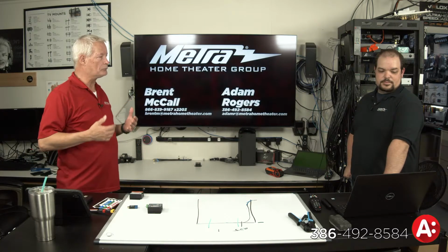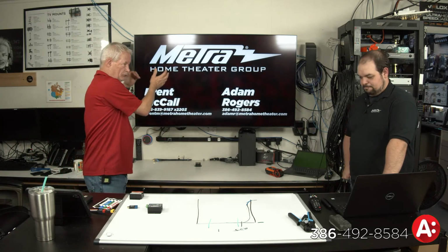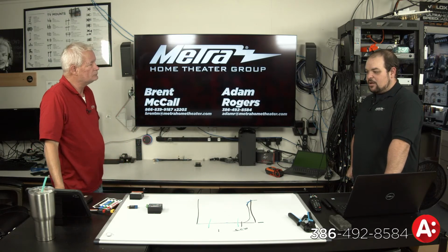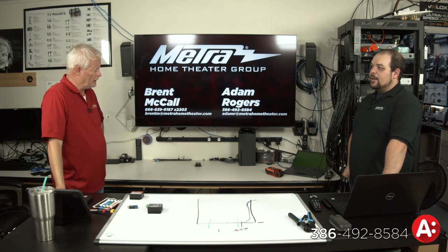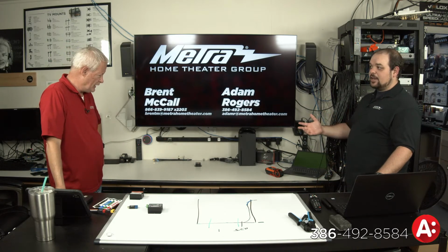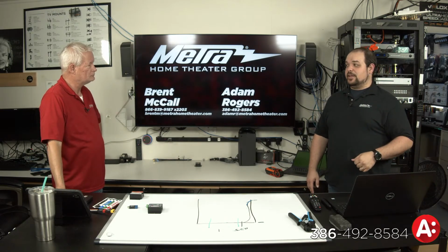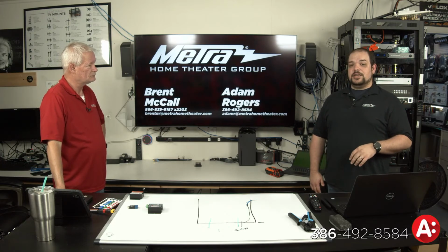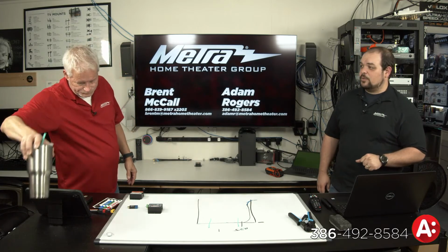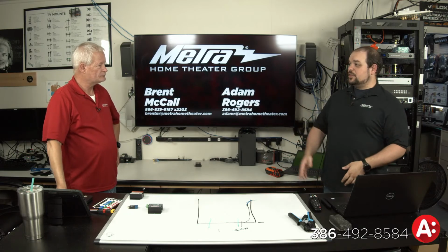Because of that reason, you and I both recommend conduit between the equipment location and the display. And if for some crazy reason you cannot put conduit into a location, put spares there: a spare HDMI cable, a spare Category cable, and a coax. And nowadays, honestly, put a spare fiber cable in there. Or, for that matter, run an AOC. Take an HDMI AOC and run that in the wall for your HDMI cable to begin with, and if you run into a problem, you can always chop off the ends of the AOC, and now you've got 4 strands of fiber in the wall.